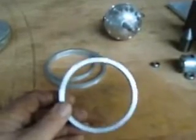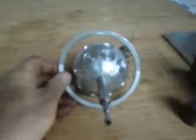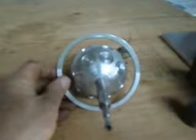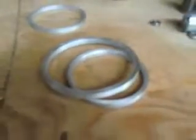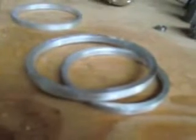It turns out that yesterday's aluminum rings aren't going to work. They're a little bit small — looks like about a half an inch — and he's going to need three quarters of an inch to be able to wrap the coils around the ring. Also he said he doesn't really want it square, so this is definitely not going to work. I also talked to him and he said it's fine to use steel. So I have some three-eighths rod here.